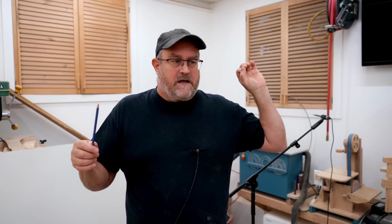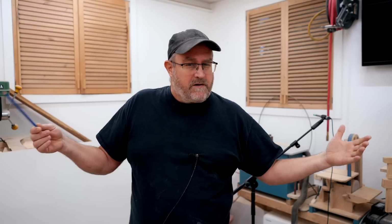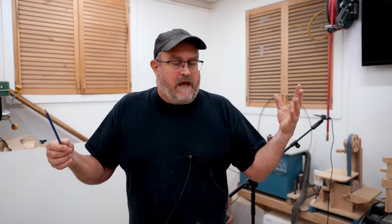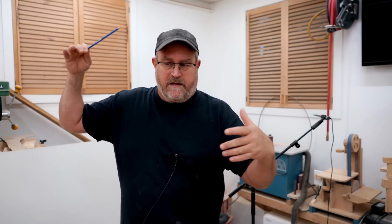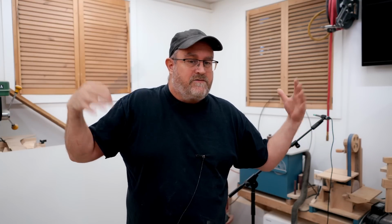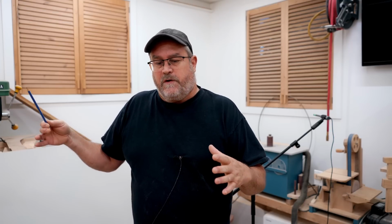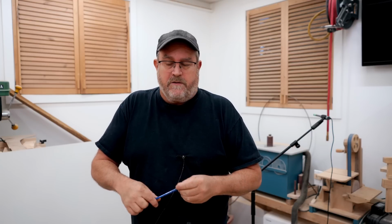Right now it's sitting outside in the sun, although it's pretty early in the morning yet. I'm going to shoot for around 4 days. This is not in direct sun. This is kind of sheltered, underneath a porch roof, so that it's getting sunlight, but it's not direct, okay? And that's how long I put the first one out for, to get a suntan, to darken that cherry. And it turned out really well.